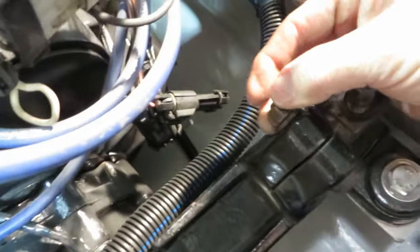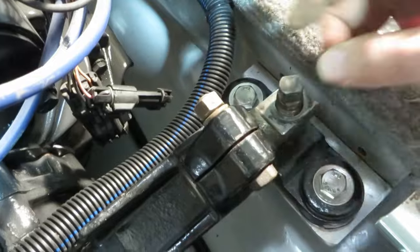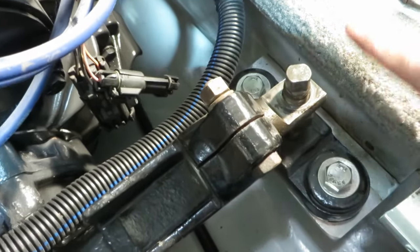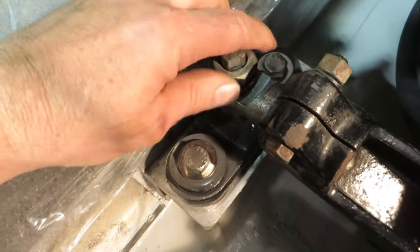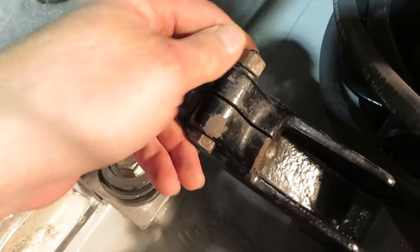There are a couple different types of trunnions out there, or the trunnion bolts particularly, that lock the trunnion still. One is a simple through bolt where you will see the head of the bolt and the nut on the back side. That is self-explanatory. It simply clamps the trunnion in place.